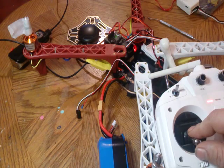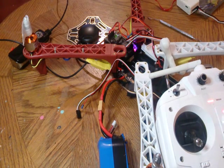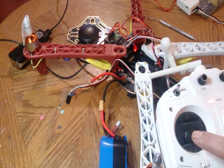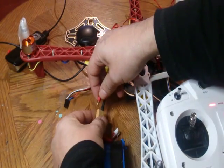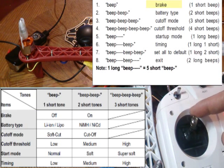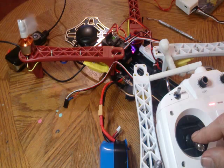Now I can test the motor. Watch the motor and see how it comes to a dead stop. I'm going to go back into the menu again by following all the steps again — I have to unplug everything. Turn on the remote, arm it, move it to full throttle, plug in the battery, wait for the musical tone. Now the first beep is for brake, so I'm going to select it and push up again. I've got two seconds and I'll push it back down. Now I'm out of programming mode and I can test the motor — it comes to a nice stop.